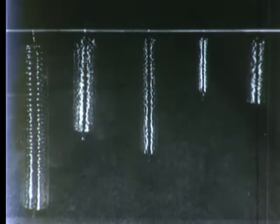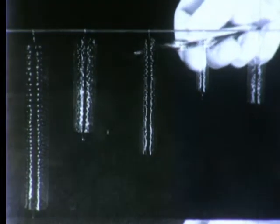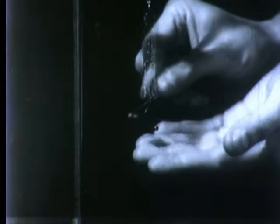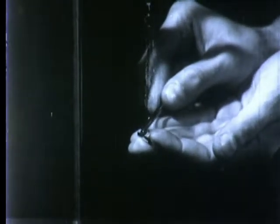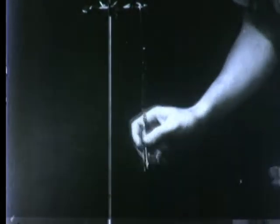Like the pioneers of an earlier day, science makes many of its own tools as the need for them arises, and these little coil springs are examples of such tools. The unusual thing about these springs is that they're made of glass — a special glass, fused quartz — and are used to measure tiny differences in weight under chemical or heat conditions in which common spring materials such as steel or bronze would be useless.